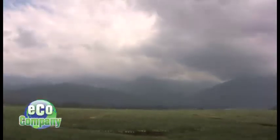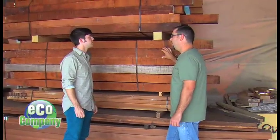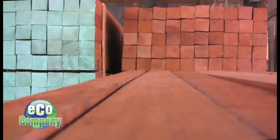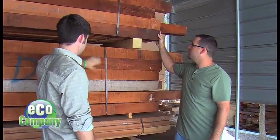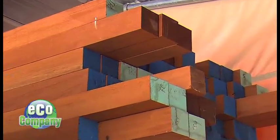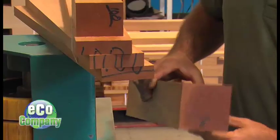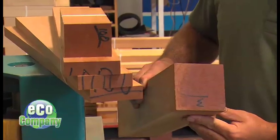Taylor sources much of its wood from Central America. This is an example of the mahogany lumber that we procure from Central America. It comes to us in this rough form, it's kiln dried, and what we do here at Taylor Guitars is take this lumber, mill it down to a smaller size 4x4 square lumber, smooth on each side, and then we'll actually re-saw this into the three pieces of neck wood that we saw on that guitar earlier.